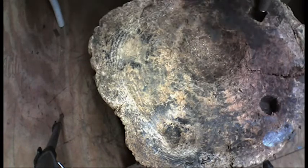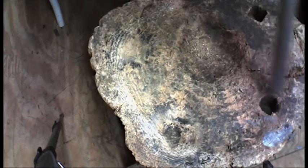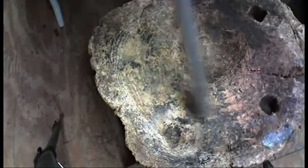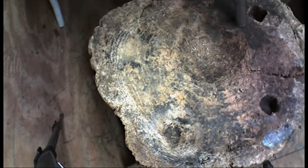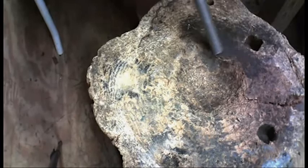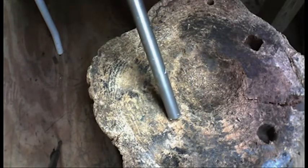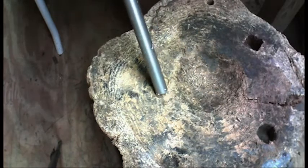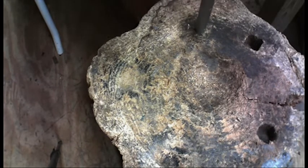Some other areas to talk about: this area here is for a square bottom stake, and this area is for a round bottom stake. I use these for forming stakes - primarily for auto body dolly stakes. I don't do a lot of forming on the dishing stump. I'll use it to do some basic knocking out of deep hammer marks. I use the flatter side of the hammer to knock out some of the hammer marks and get a straighter, more flat surface - so it doesn't look like the surface of the moon.